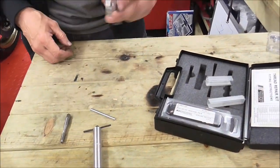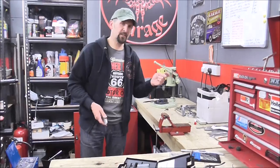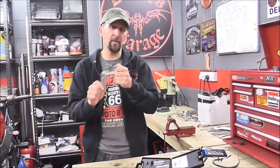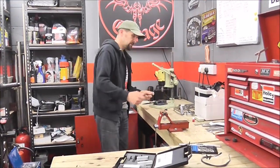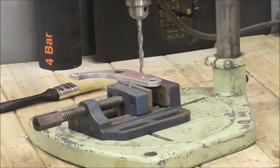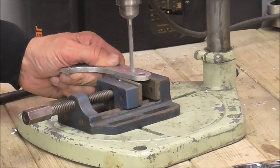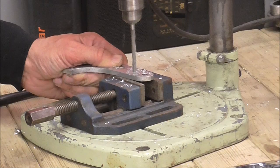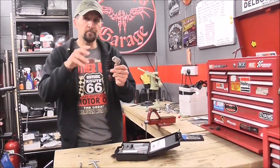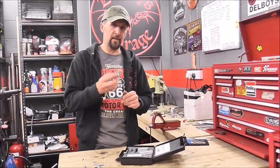I'm going to drill the hole first of all. The first thing we need to do is get all that cleared out, and that simply means a six mil drill bit. If it's an M6 hole, you drill a six mil drill bit — it's the same size as the hole that it was. If it was an M8 hole, use an 8 mil; if it's an M10, use a 10, and so on. So drill it out to clean it. Now in this instance on your engine, you're going to have to go in through the engine by hand, but I've just got a drill so I'm going to do it on this one.